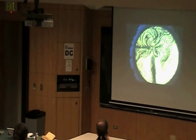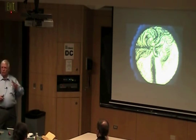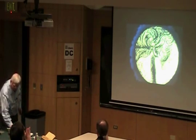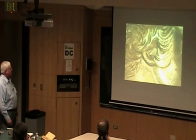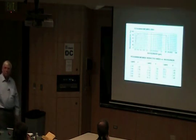This is that same piece I showed you before, but with light coming through it. You see it's transmitting light. You can see some pretty fine detail. You can also see just the finest traces of some of the particles that weren't quite squeezed together. It's a little bit hazy looking, but that's for visible light. When you go into the infrared, the scattering improvement goes, like for the blue sky, inverse fourth power of the wavelength, so it goes away rather quickly. Close up of a part of the structure. You can really see every detail that was on the metal.